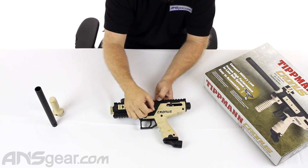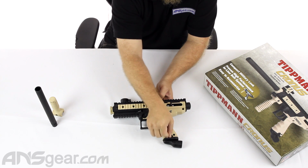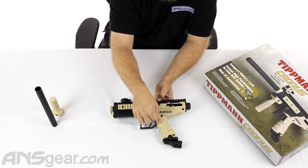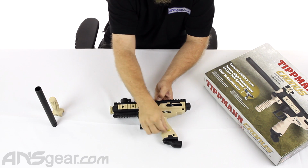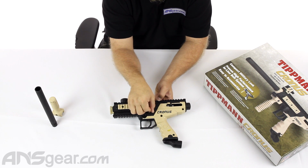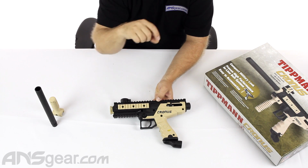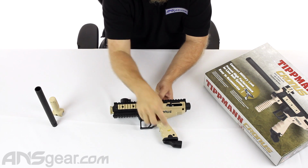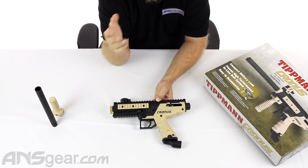They've got a brass tube. Yeah, a brass one, it's not copper. A brass tube that runs from here, that's got an O-ring on the bottom of it that mounts into the ASA, and then it runs up in a very specific little path that they've made right there, and then it attaches up into the top. So there is actually a pipe that runs down there that transfers your air up through the grip frame. It is not a passageway machined into the grip frame, if that makes sense.